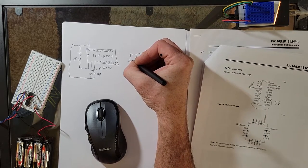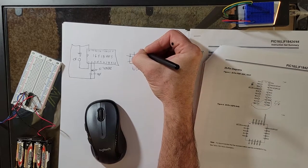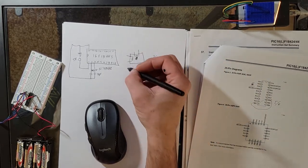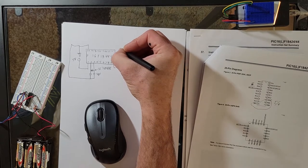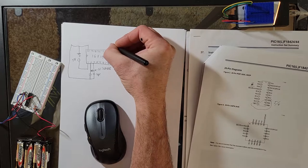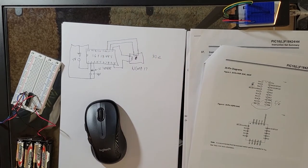But yeah, the way it would look inside the stepper motor would look like that. Just two coils with two wires. You can get an ohmmeter on there and you could find out which wires belong to which. But in general, we'll put one directly attached to number 10, one directly attached to number 11, and the other two wires will be attached to 12 and 13. And that is the project right there, okay?